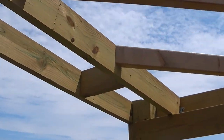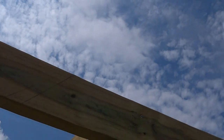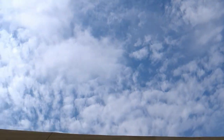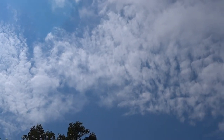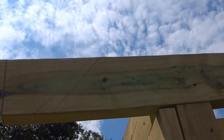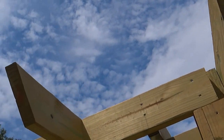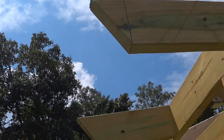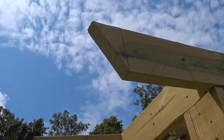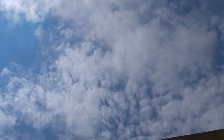And then my two rafter rims. I was going over and over in my head — am I going to have to cut these off and reattach them with the four-degree slope at the back? No — you can just take the top and figure out a four-degree pitch across the top like that. The bottoms won't necessarily match up, but I don't care about that. As long as the top angle matches so the tin will be at the same angle as all the other rafter tails, and the water will drain off.